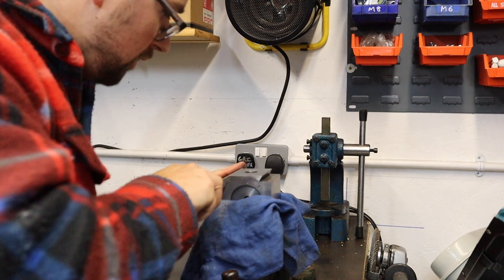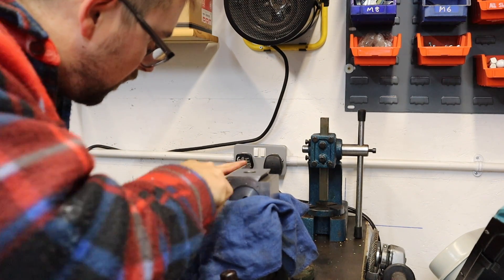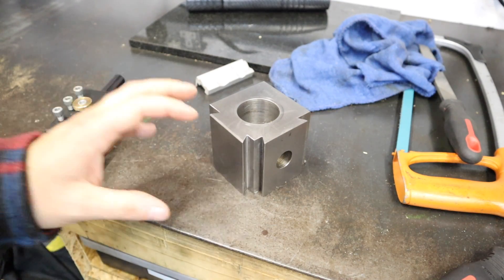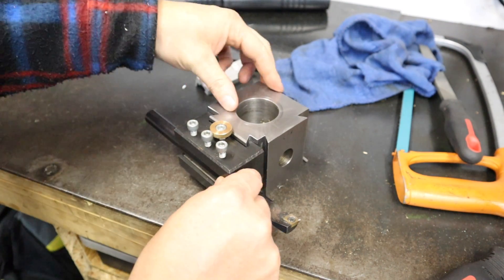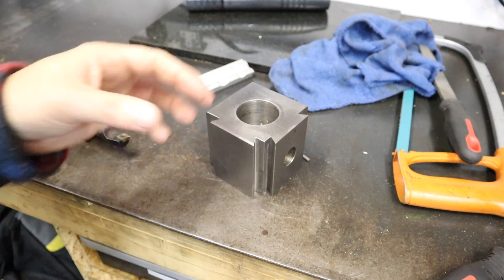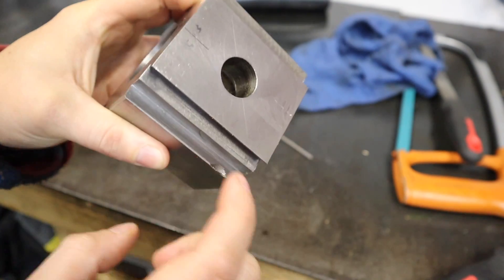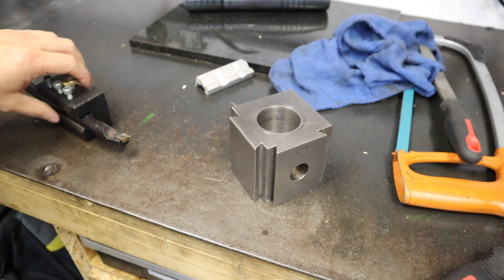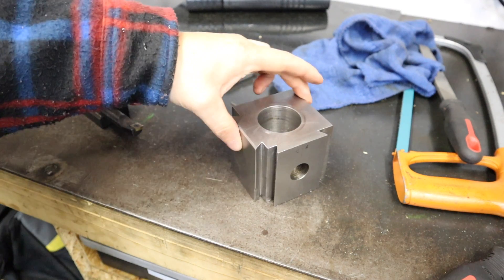It hasn't done too much damage but it's the last one I've got, so we're going to be doing a lot of hand filing with a 60 degree triangle file. I'll tell you what, this filing in the evening just seems to go on for hours - it was probably more like 10-20 minutes but in my head it felt like I'd been out in the workshop for hours. After what seemed like hours of hand filing, I've managed to get to a point where the quick change tool holder slides over the post really easily with barely any movement. The broken tool did do a little bit of damage down the bottom there, but it's not going to affect the overall performance. I'm going to live with it - it'll be a nice little story to tell. Next thing I need to do is drill a hole in here.